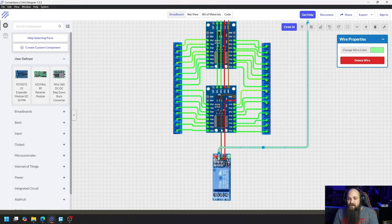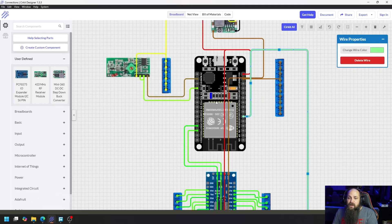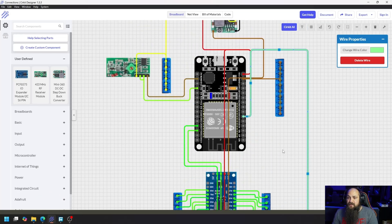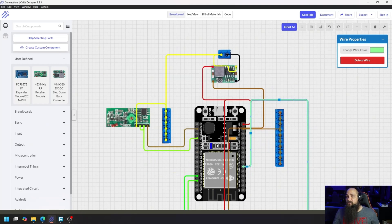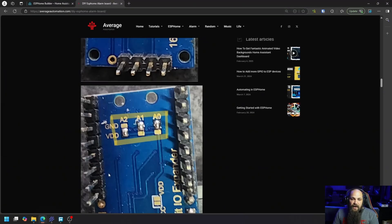The main idea behind this board is to have something where you can replace each and every single component - you can unplug and replug any of them very easily without replacing an entire board. This is the first time I'm attempting this, so there are a few items I'd like to improve upon. Make sure all of these are matched, and very importantly, adjust your voltage before actually connecting the ESP32. I'll leave more information in the written guide below.